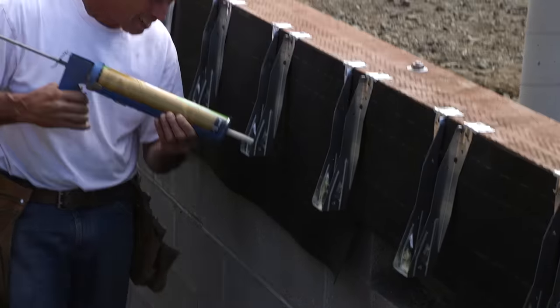This is one of those things where if you don't do it exactly right the first time, there's no fixing it. Let me repeat that. This is one of those things where if you don't get it right coming out of the gate, you can never make it better. So this is not a place to try to save 10% on the net cost of your floor system by increasing the span or increasing the centers in order to save two or three pieces of material. Just don't do it. This is a place to go a little beyond the mark.